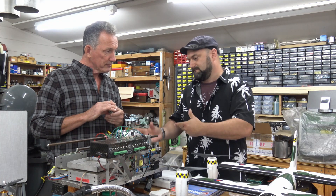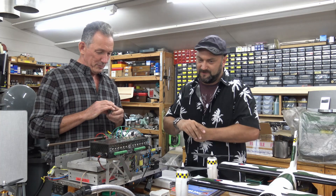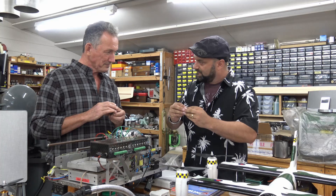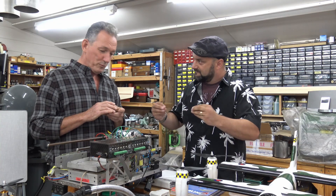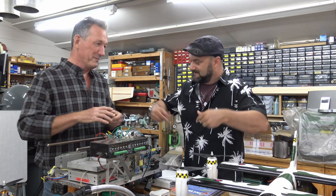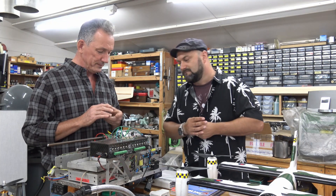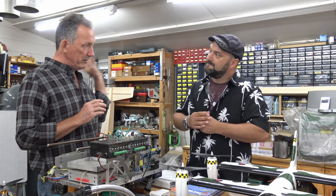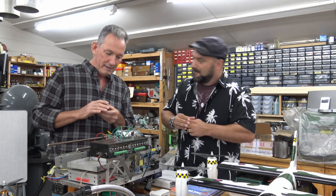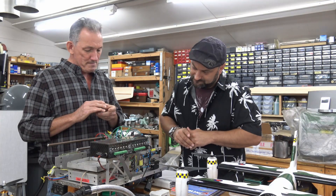What kind of equipment do you need to make your own jet engine? Looking around your workshop — you've got a lathe. If you look at it practically, it's all essentially cylinders of one sort or another — basically a large amount of rotating work. There is a small amount of milling, which I actually do manually on the lathe using a vertical slide, converting it into a mini mill from a standard lathe.